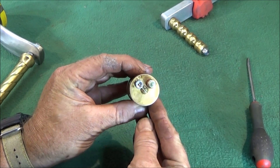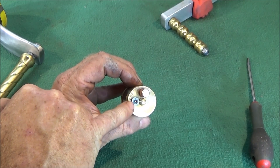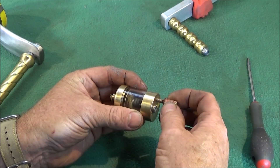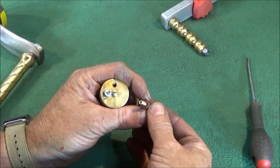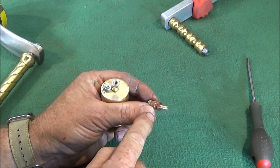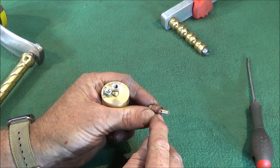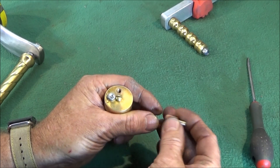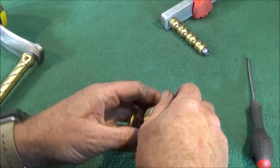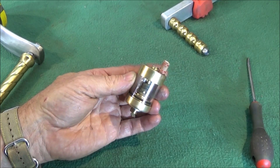This is what it looks like close up. I have the concave oiler on the top — there's no need to take the cap off to fill up with oil, I can use my ordinary pressure oil can. The valve I made is just a small piece of bar threaded with a 2BA, with a fine hole drilled up through and one in through the side. If you do make one, just make sure you drill the side hole a few threads down from the shoulder, and allow for the fibre washer. If you don't have it too far down the thread, you don't have to unscrew it too much to reveal the air hole. So that's the final production model of my wick feed oiler.